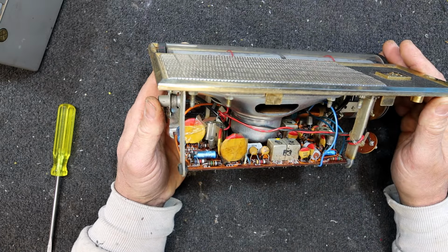And it's got blue coating on that side, and looks like they've got an orange trace on the other side. So you know where the tracks go from if you're looking at it from that side. Yeah, that's the antenna socket. Through a choke into a very nice big antenna rod here, which must couple the external antenna onto this coil here, which couples through the ferrite to the main antenna rod. Yeah, another trim cap and a little tubular cap or something stuck on there.